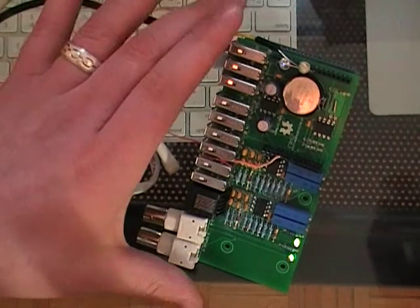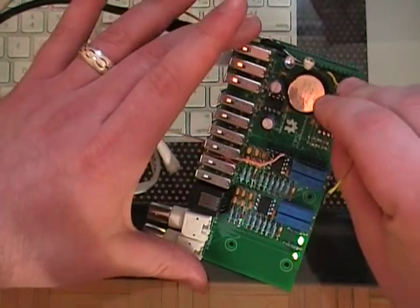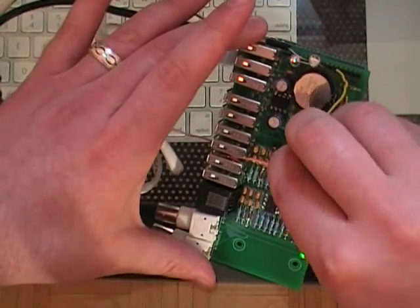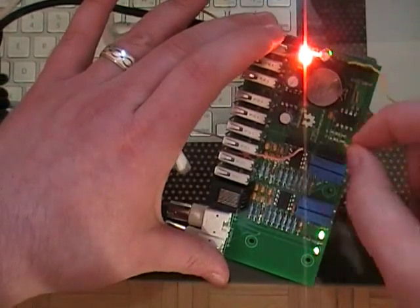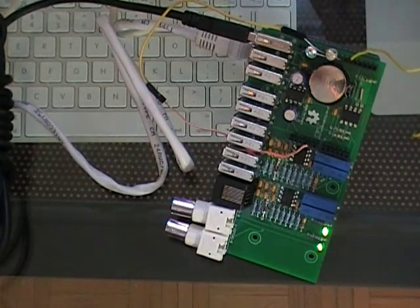Anything higher than that is a PWM value. Okay, so now that we've saved that, if we take pin 5 and plug it into high, so just 5 volts, you'll see it turn on. And if we pull it out, it goes back off. So that's definitely useful.